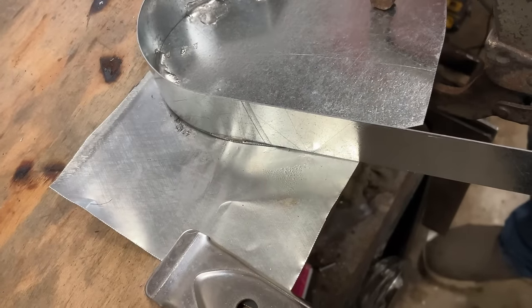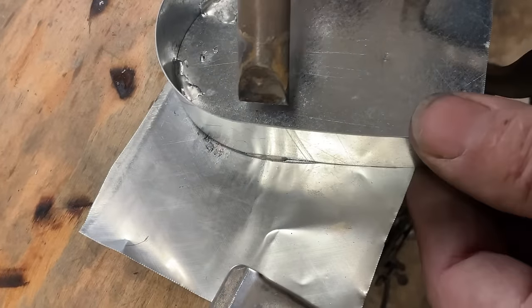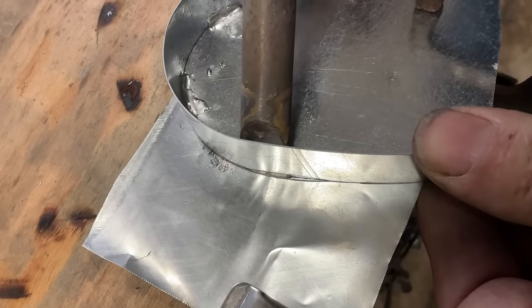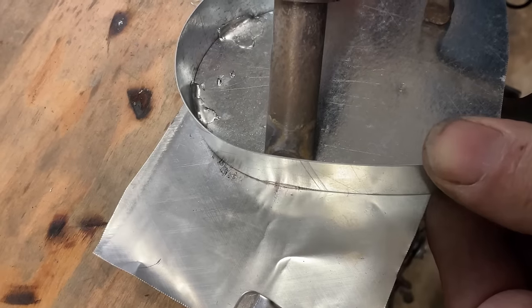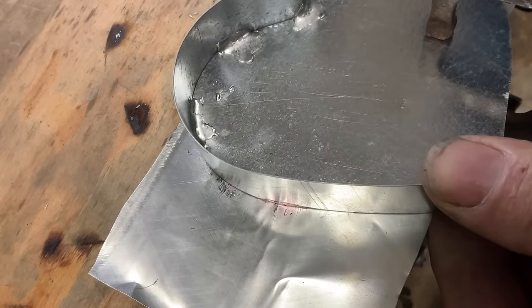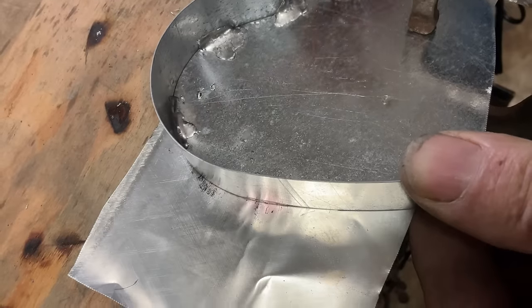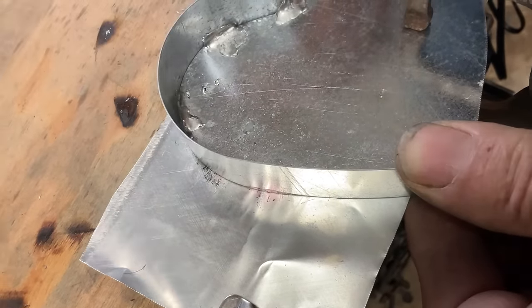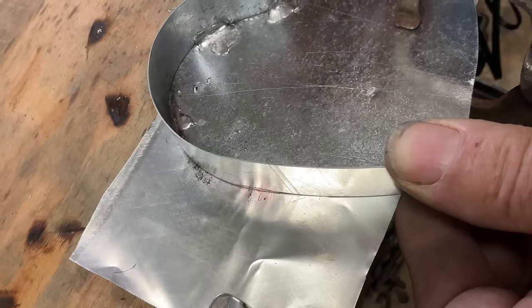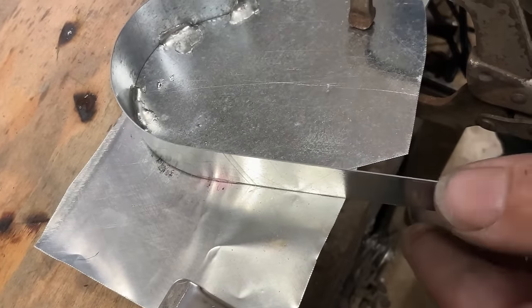What I'm going to do is reactivate that solder, so I'm watching for that. I'm going to reactivate that solder and push this out where I really want it. I hope you saw what just happened there. See how we moved the fence, this vertical member, out and corrected our mistake? That's one nice thing about the solder. And I think if you just stay right there,